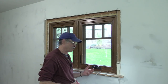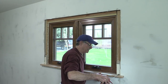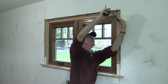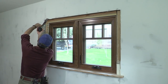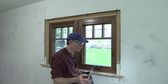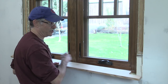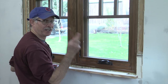The last thing to figure out is how wide the jamb extensions are. At the bottom I just measure the notch in the stool. At the top I cross the drywall with my square and measure out — it's two and a quarter on both sides. So I've got to cut tapered jamb extensions going from two inches at the bottom to two and a quarter at the top. Now that I've got all my notes on the sill, I can take this up to my shop, cut the jamb extension legs and the head, assemble it in one piece, and bring it down and hope it fits.